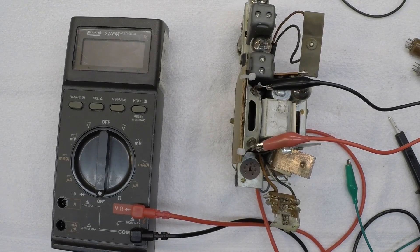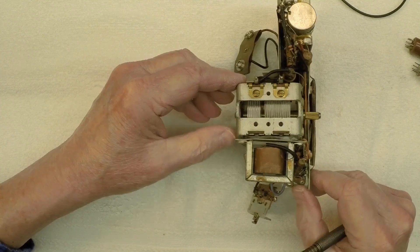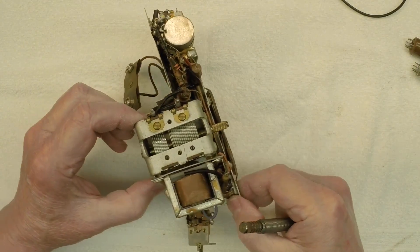That's a good sign. It appears, with this test, at least the voice coil is good. Again, no indication at this point if the secondary of the output transformer is also faulty — we'll pull it out and do some additional testing. Most likely just the primary is open, and I'll probably end up having to take this over to the bench itself and see if I can better support it.